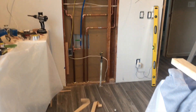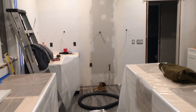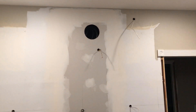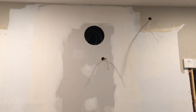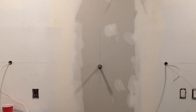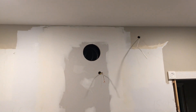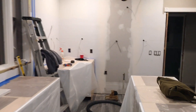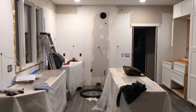I'm going to drywall it up, get everything taped, and get back to the project at hand. The wall is all back together and everything is in its proper place — the vent has been moved over, there's a wire sticking out that'll be the plug for the vent, the pot filler is moved over, and the plug at the bottom is done. It's been taped and spackled, needs one last sanding, I'll hit it with primer, and then we'll get these cabinets back in place. The next video will be of the cabinets installed — stay tuned.